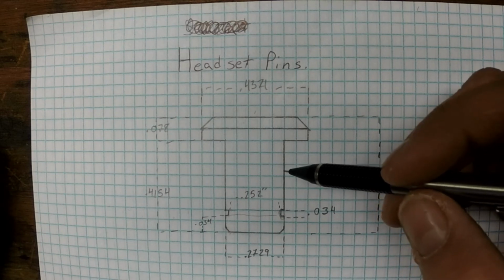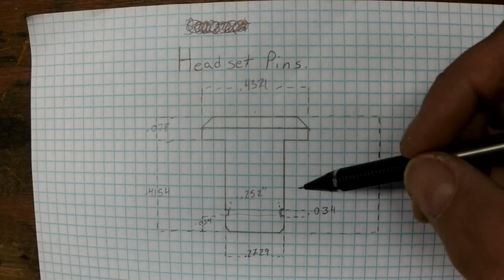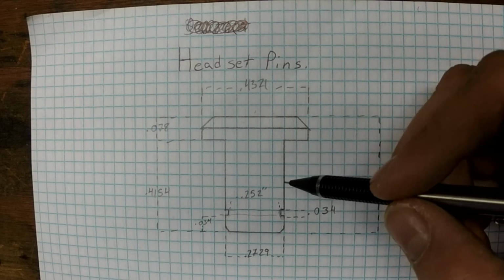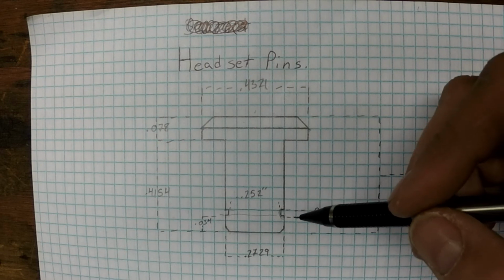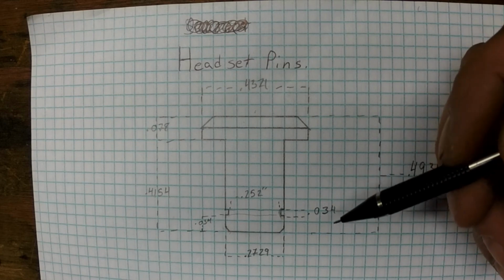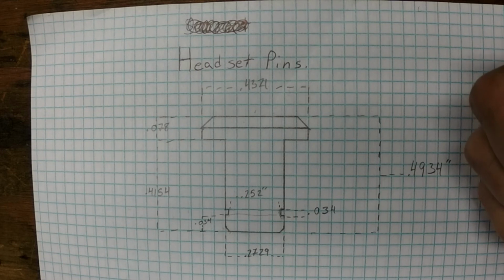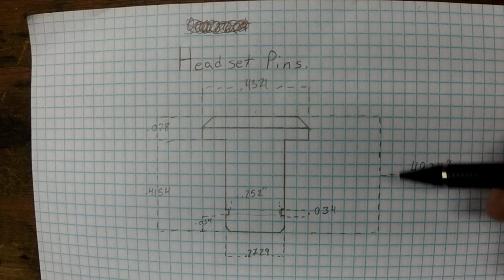So I've got some decent steel, some drill rod left over from another project, I'm going to be making these out of. I've got 10 of them to make, so I'm going to try to get a rhythm going and get all 10 of them done. And then I'm going to sandblast them and blacken them with the Oxpho bluing system, which seems to work really, really well for me. Really liking the looks of it. When you apply it to a polished piece of steel, it turns it blue, like the blue steel of a firearm, but when you sandblast it first, it turns it black almost perfectly, like a black oxide finish. So that's what we're going to do. I'm going to get the parts set up and move the camera over to the lathe, and we'll get going on this project.